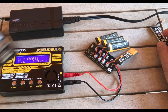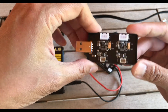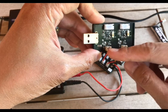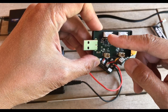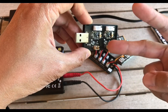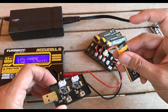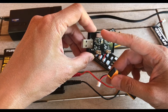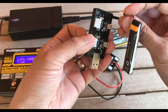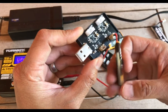One bonus item: this board here is actually a charge board, not a parallel board. It looks like a parallel board but it's not. This one can charge single-cell batteries — those two ports are for 1S — and it can also charge a two-cell battery. The balance lead goes in one port and the power lead goes in the other. For two-cell batteries, one lead goes here and the other goes there. Since we're only charging single cells, you just put the battery in the single-cell port like so.